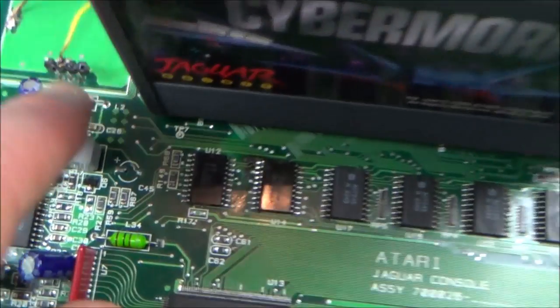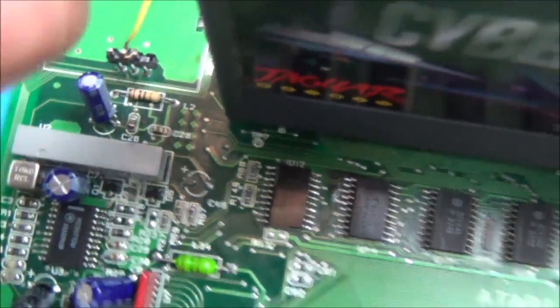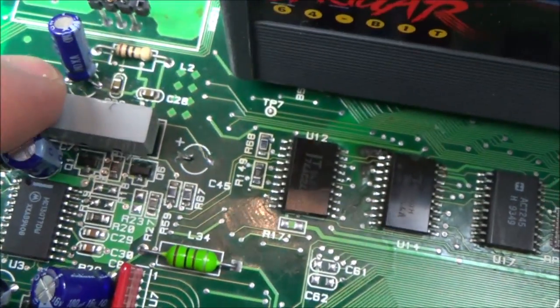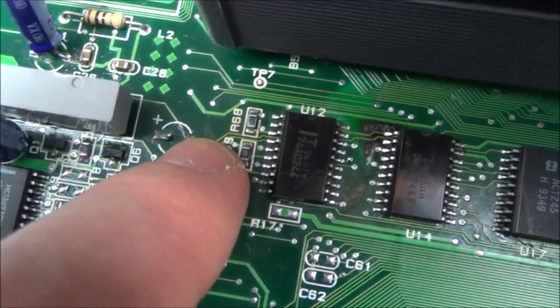Now, isn't this interesting? From the middle pin here, it goes through the board, goes through a tiny little surface mount capacitor. So you can see just that middle pin there. You've got a surface mount capacitor that joins it up to that rail there. But then look, it goes down here to that pin in between the two legs of the capacitor, which is that little pin there. That little pin then goes along and it actually comes up on this one here.